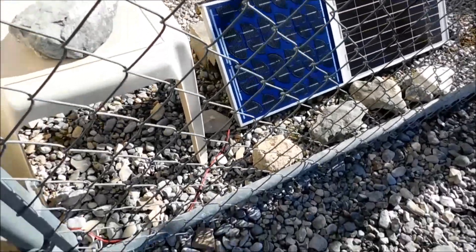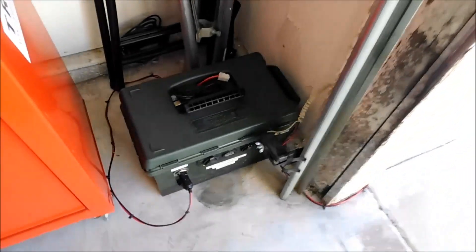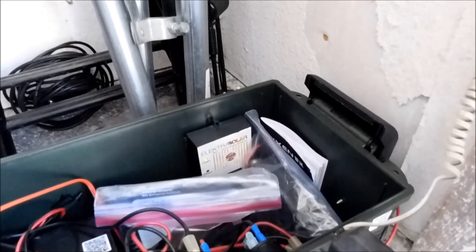I don't know if the camera will pick up the red and black cable — I'm eventually going to get some cover for that. And it runs right into here. That's where I keep my kit ready to go and charged. Let's give you a little look inside. You can see the charge control in there is green. That usually didn't happen with the smaller panels, which were, I think, two 5-watt panels — I'm not sure, because they weren't marked; I got them for free. That used to take until about noon before it was green, and when I came out here at about 8 this morning, it was already green.